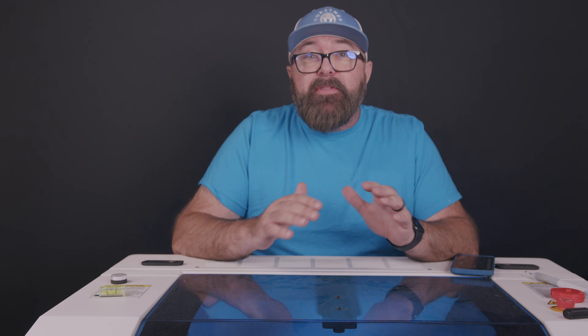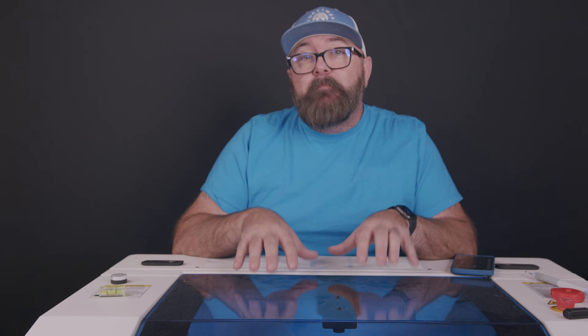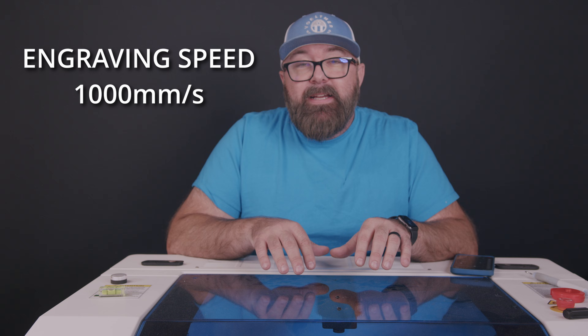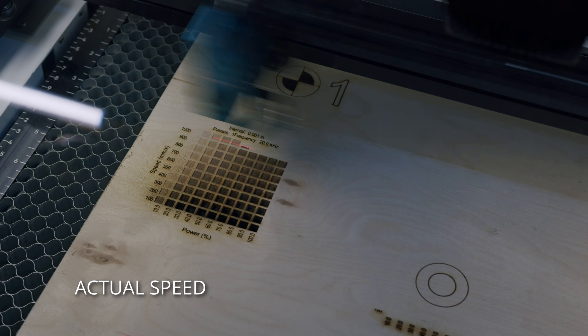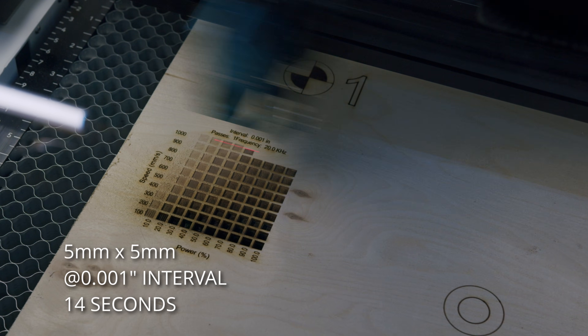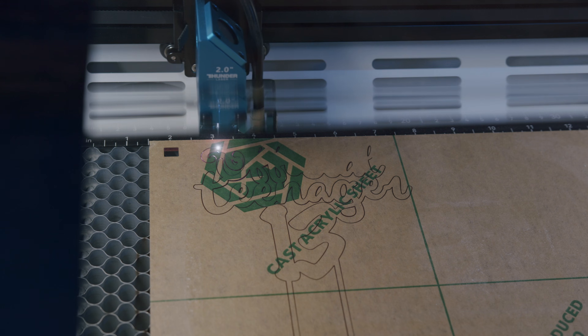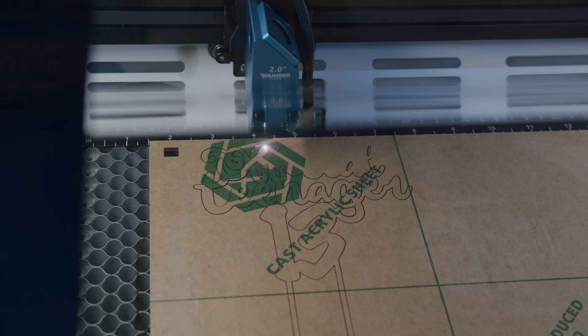Before I cover the power of this machine, I want to talk about the speed because it directly ties to the precision and lens choice I just mentioned. The advertised engraving speed is 1000 millimeters per second, which is super fast. This video isn't a direct comparison to any particular machine, but make sure you're subscribed because I will be doing a comparison video very soon. Compared to many other machines at this level, it's about 40% faster. Now to be clear, this is the engraving speed — depending on the materials you're using, your cutting speed is going to vary, which is very different than the engraving speed.